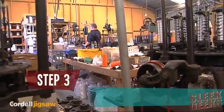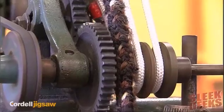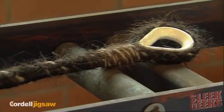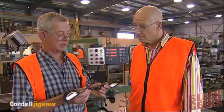Step three. Professional rope maker Greg Smith uses traditional methods to turn the hanks of hair into rope. We've had a lot of strange requests, but this is the first one we've had for human hair. In the process of turning into rope, we're going to lose an amount of strength. The uncertainties are how strong it is as an assembly. There's certainly more than enough fibres in here, if they can all be load-bearing, to pick up the car.